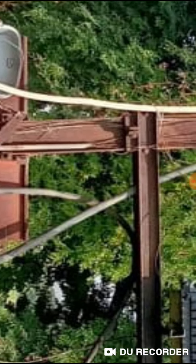Now, please see this cable. It is going into the ground. This cable needs clamping as per CEA regulation number 82. Very haphazard way of working. Why do I say so? Because if the cable is not clamped, it will cause a jerk to the connection at the bushing end and the distribution box end, causing sparking. Hence, cable clamping is essential also to counter the gravitational weight of the cable. Please see, sir.